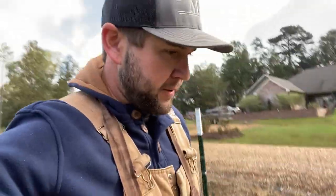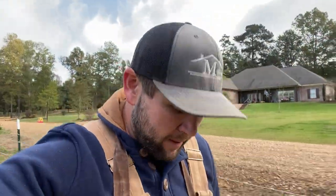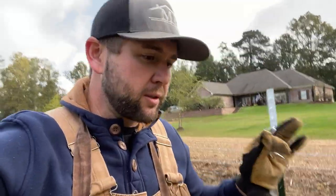Aiden is doing homeschooling right now, so he can't be out here to help me quite yet. And neither can one of my daughters, but unless you have about 6 hands, you need an apron. I carry an apron, and that way I've got my anchor bolts, my staples, my hammers, my tools, and also my fasteners, T-post fasteners. So that way I'm not reaching around, I'm not trying to haul it all. It makes it where I can get stuff done a little bit quicker.